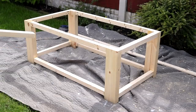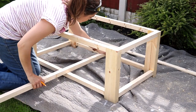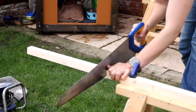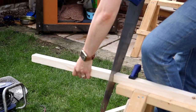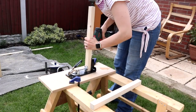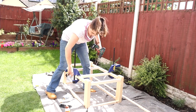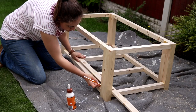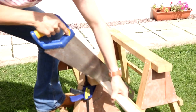After putting that to one side I thought I really needed some extra battens for the bottom shelf because I was going to put some slats there, and I knew because they were quite thin they'd be wobbly. You'll find all of these pieces in my cutting list — I pocket-holed them again and glued and screwed them on. For the slats, the front and back ones needed to be shorter, so I held them up against it, marked them and cut them down.